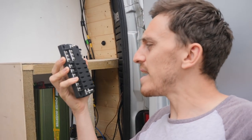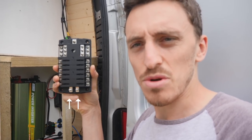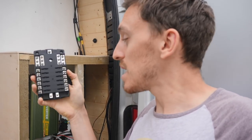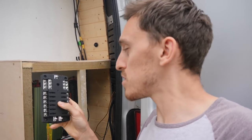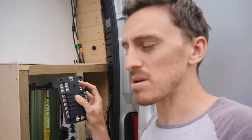So I finally went out and got a 12-volt distribution board. Basically I put this on the wall, and these two ports down here are the positive input bits — I just strap my battery directly to these points — and then I've got up to 12 accessories I can attach. All of these are fused 12-volt distribution ports. Here's my negative port up the top, so I can take everything out, bring everything back into these ports, and complete that circuit.